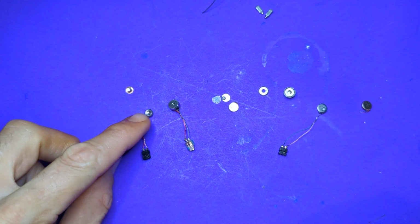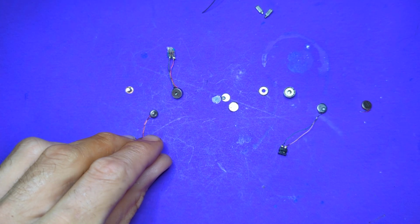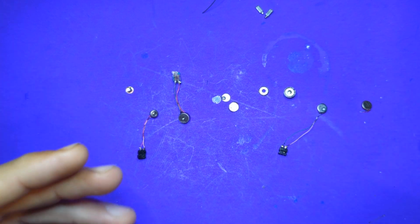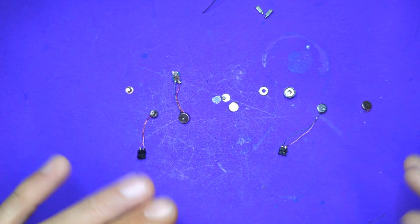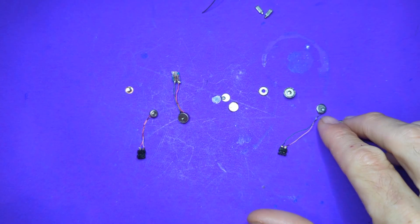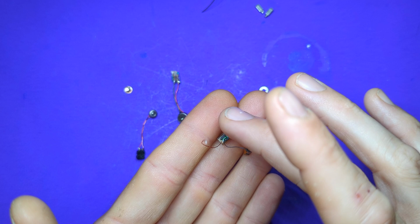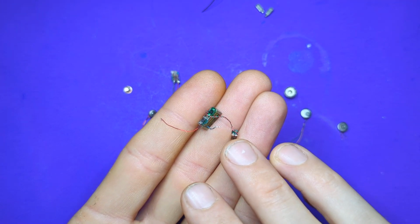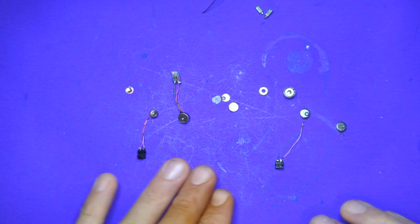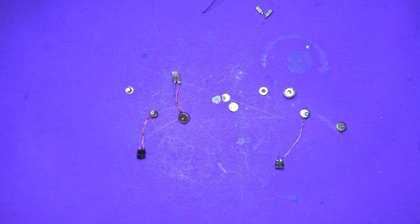I mean, even the 5mm beryllium domes that I have have some weird issues with timbre. But the extension's good, frequency response is good, but timbre is the big issue, and that's what these companies are working on. But I'm just excited. I hope that more companies go forward and keep refining this technology, because this is much cheaper to produce than these. These are very expensive to produce because of the wound transformer and the delicate nature of the electrostatic unit. So these are much more affordable for manufacturers to produce, which means that they are much more affordable for you to enjoy.